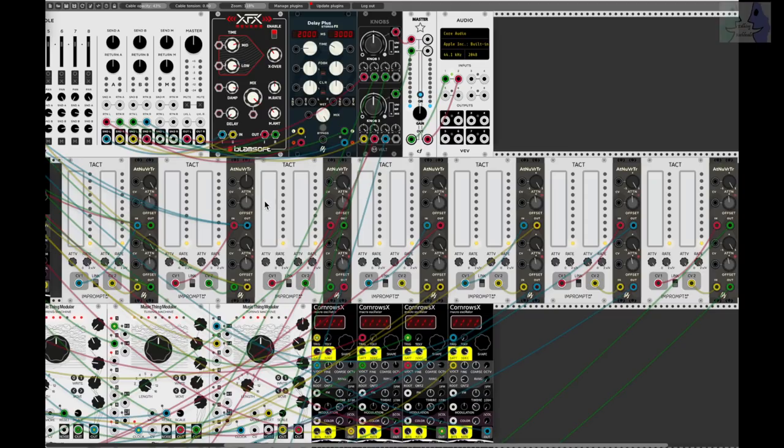But fundamentally, what I'm doing here is that each module is set to have a rate of increase or decrease of 2 seconds per volt. And what that means is, for every one of these lights you see, that is actually a 1 volt increase. And it's a gradual smooth increase between zero and one, and one and two and three and four, and so on. So it's a gradual, like someone's moving a slider on a mixing desk.